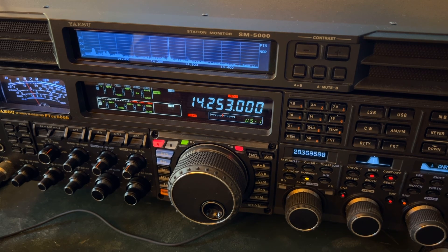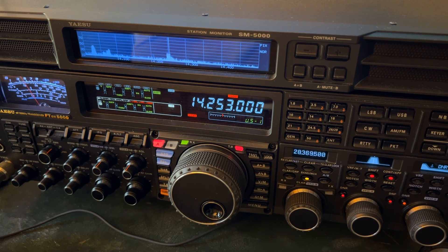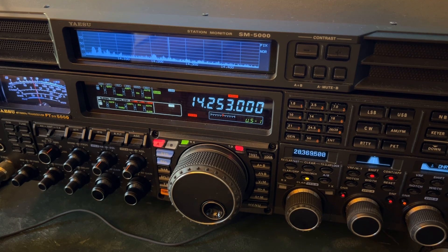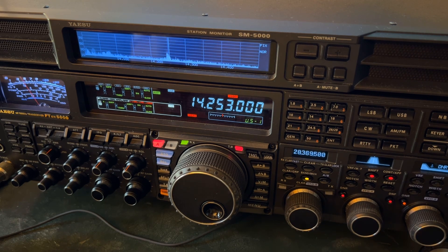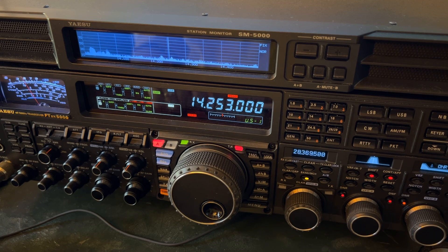You can just remember: shift negative to get rid of a high pitch metallic sound, shift positive to get rid of — or I should say minimize — a low pitch honking sound. Does not matter whether it's lower sideband or upper sideband on these modern rigs with DSP. Prioritize getting rid of the high pitch sound because the low pitch sound, while annoying, can be tolerated, and you can still pull out who you're trying to hear.